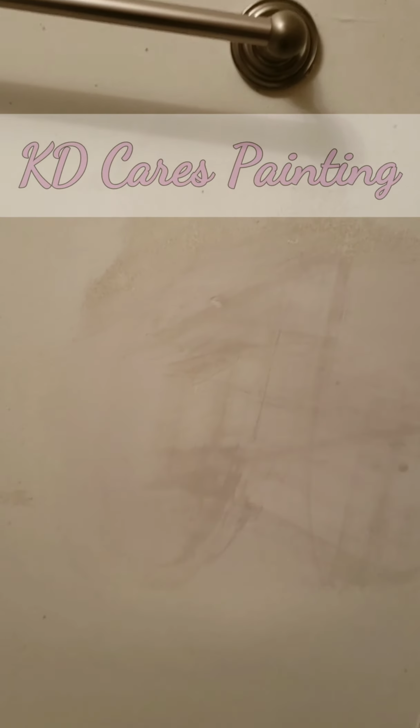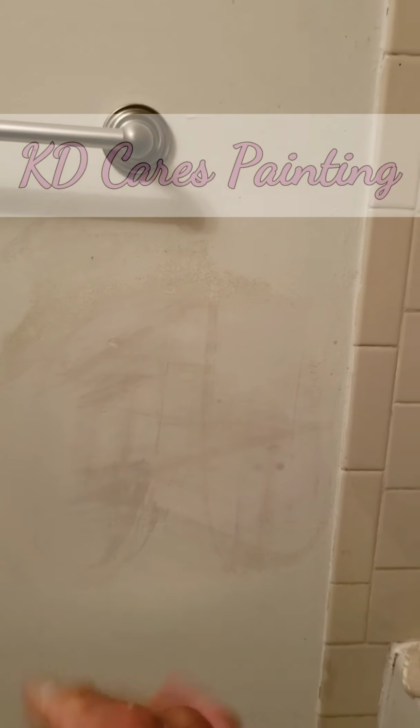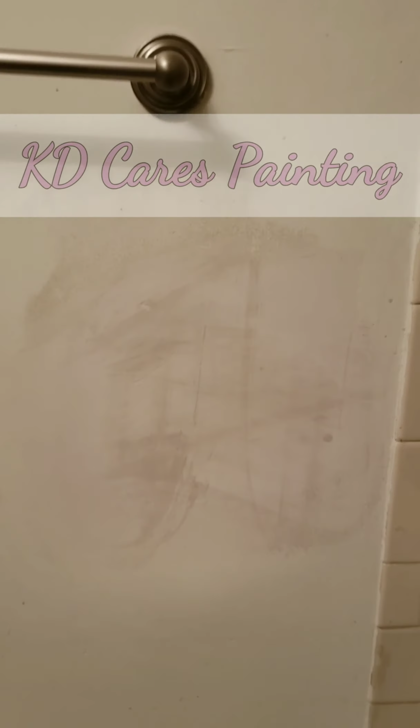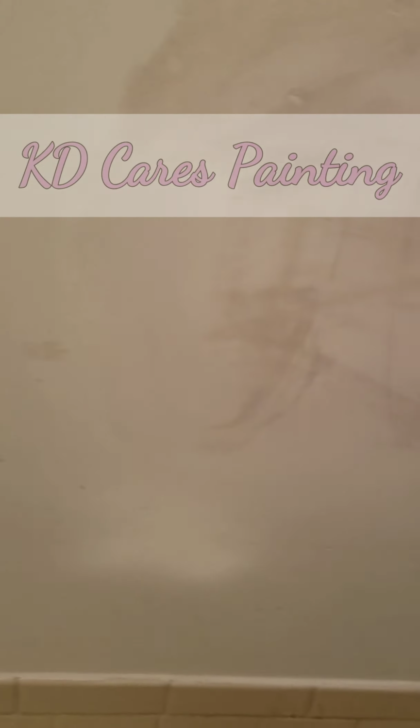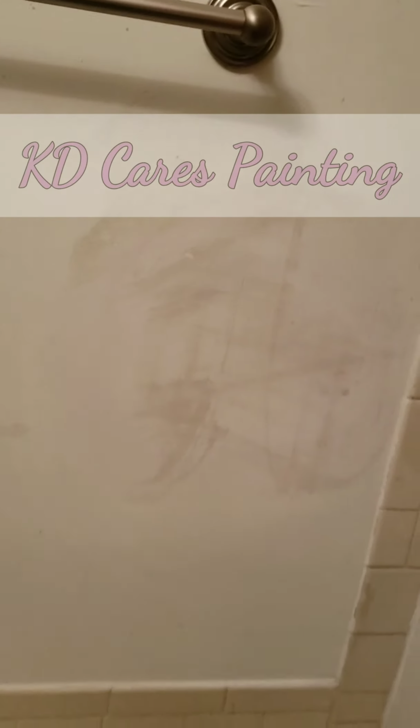This is called the polish. This is just to get the finest of the finest creases and maybe knife marks and what have you. Now I sanded it and I gave it a quick damp mopping. Now my last coat of compound is even more loose and liquidy than the previous two. I want it to be thin and smooth to go over this whole area here.